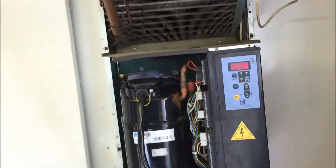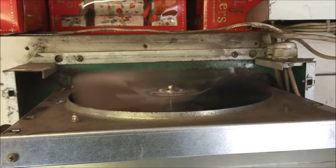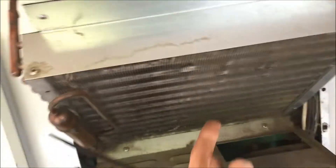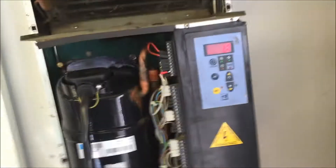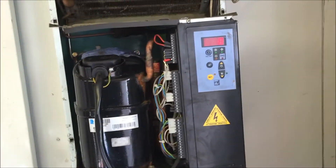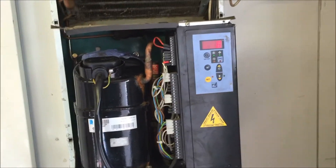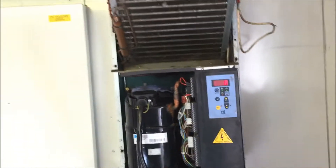Okay, the result — turned on straight away and the fan's kicked in. I know it's going the right way because I can feel it pushing that way. So airflow out there, comes out here. Compressor's on. Just going to watch it come down to temperature now, and then fingers crossed all is okay. So yeah, it's just a condenser fan.